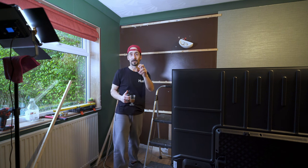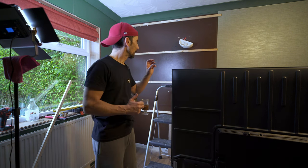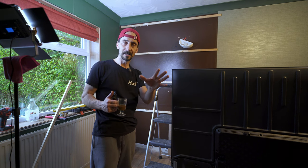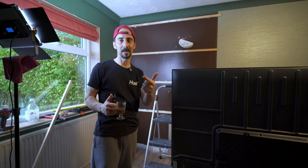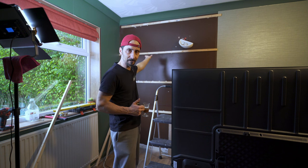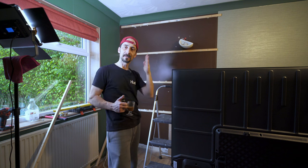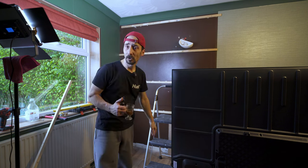So if you ever install slot panels: if it's just for decoration and aesthetics, absolutely fine to stick them straight to the wall. But if you want to run cables behind — audio cables, internet, power supply, anything — I do suggest going the extra step, putting battens on the back, and bringing your panels a little bit forward so you have that lovely area between the wall and panel where you can run all your cables. And it still looks great.